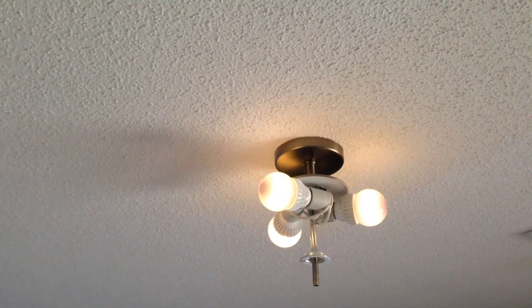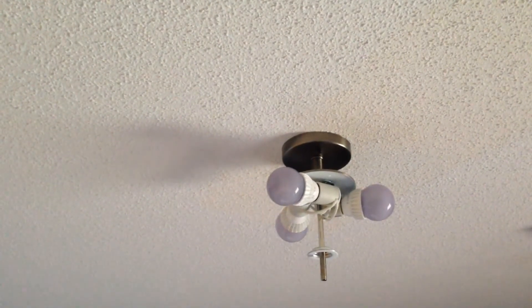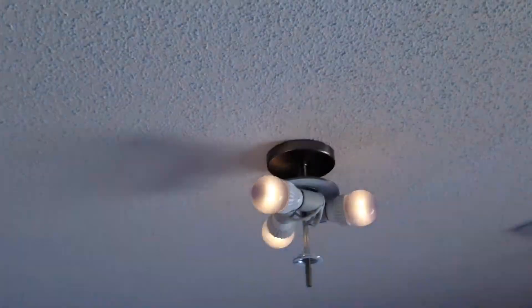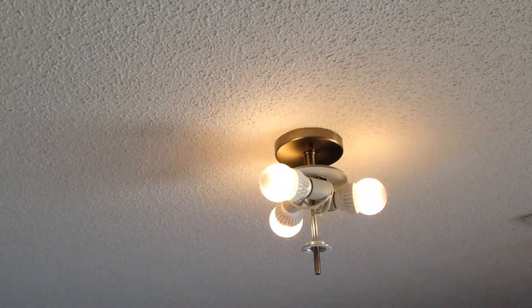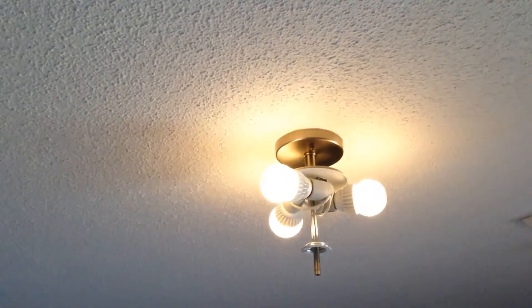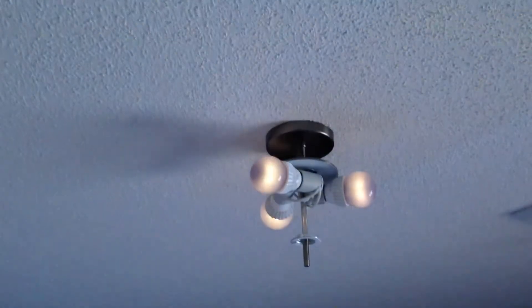It's not a big deal — very slight. It looks like it goes very dim, which is great. Now I'm at the bottom of the dimmer where it just barely turns off, and you hear a click as I turn it all the way off. It's working quite well with the dimmer. If I go just a millimeter from the bottom of the Lutron dimmer, it stays barely illuminated. There seems to be a little delay at the low levels where it kind of decides what brightness to stay at — it's not instant. At the top levels though, it's basically instant on.